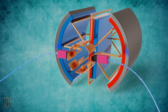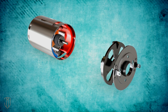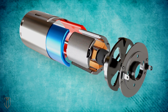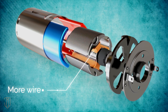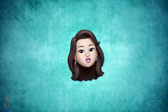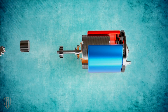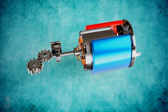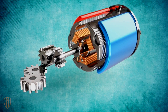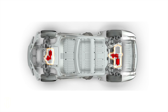What if we want the rotor to spin faster? This spinning force is called torque — more torque means faster spin. To increase torque, we can do a few things. First, we can increase our electricity — in other words, use a larger battery. There's another trick: we can also wrap more wire to each armature loop, which makes the electromagnet stronger and therefore spin faster. And this, in essence, makes up a DC electric motor. The spinning motor can be connected to gears and the energy can be converted to other movements to power household gadgets, appliances, and ultimately your electric car.